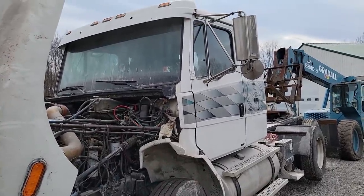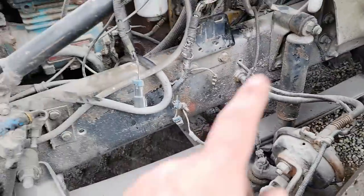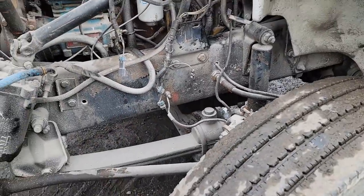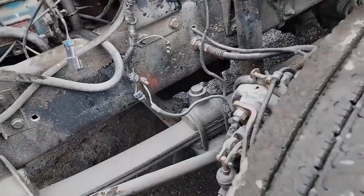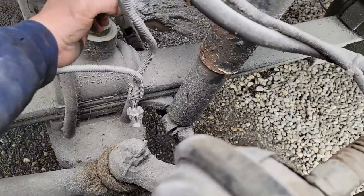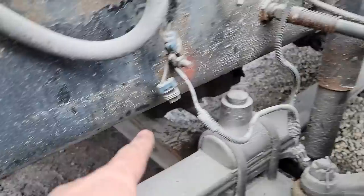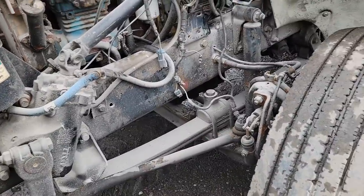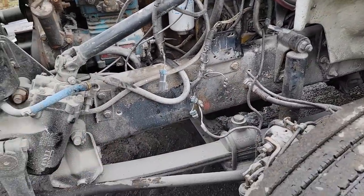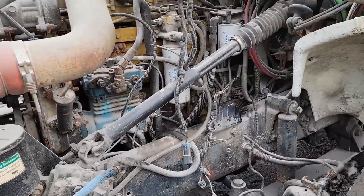Thanks for watching. Actually, that's not gonna work — this should have had a front sump motor. We may try and get this thing running and then do something else, because look at the distance between the bump stop and the frame — that's like an inch. That will break that oil pan in a hurry. So that oil pan needs to be flipped and put in the front. I don't know if CAT works like that or not, but it looks like the motor may just have to come back out. We'll try and get it running first and see what we can do.